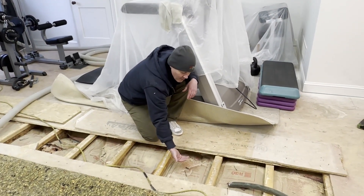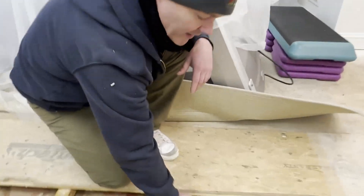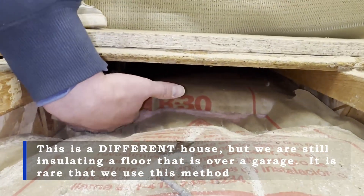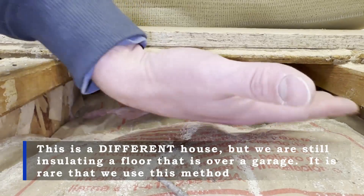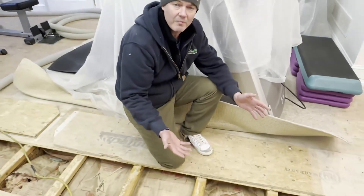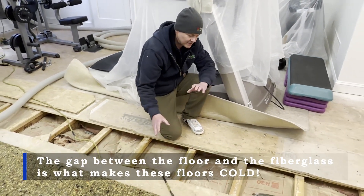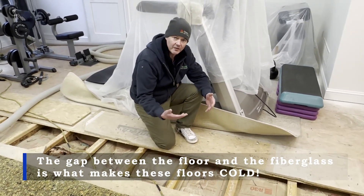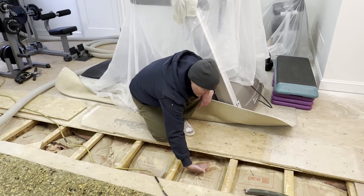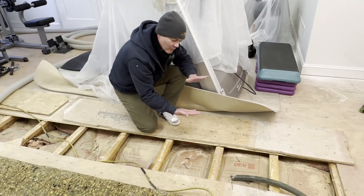To avoid confusion, I'm narrating over a prior video because the original sound quality wasn't good. In this case, we are re-insulating the garage ceiling from the room above by cutting through the subfloor. Here I'm showing the gap between the floor and the fiberglass insulation. This gap occurs in nearly all garage ceilings insulated with fiberglass batts, whether the home was built in the 1950s or two years ago — and this gap is what allows cold air to infiltrate between the floor and the insulation, making your floor freezing cold on winter days.